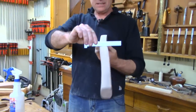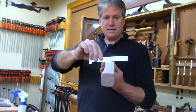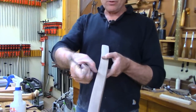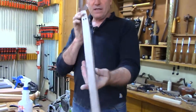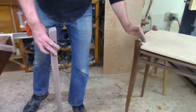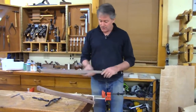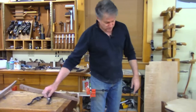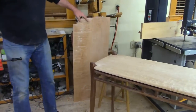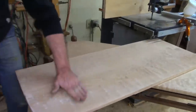If you look at it, can you see that angle? Lift it up. There? Can you see it? Yeah. So you see how much, it doesn't look like there's that much there because we didn't even come over an eighth of an inch, but it gives it this sculptural feeling that changes the whole game. So these legs here have that pillowing effect on them. And then we did the same up here on the top. And what a difference. So this top edge will also get this kind of pillowing effect where that edge comes down and over, similar to this one we used as our demonstration the other night to pillow that soft edge.